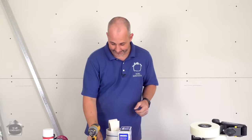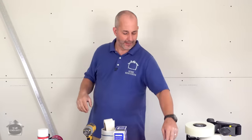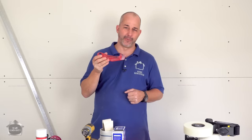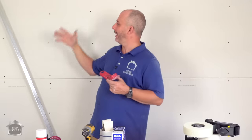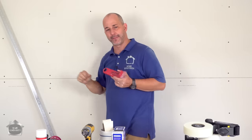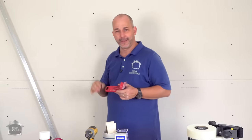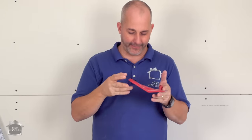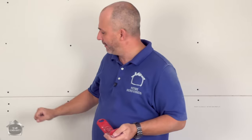Now, that takes us to a place where now we have our drywall installed, almost. One other thing I'm gonna suggest is some kind of foot pedal. Because when you're doing drywall, we put the ceilings on first, and then we hang the second sheet nice and snug up against the ceiling, and then we put the bottom sheet on. And if you're in most places in the world, the second sheet of drywall, even after it's installed, has a bit of a gap. So you put this underneath that drywall like a foot pedal, and you can step on it and lift your sheet up nice and snug.